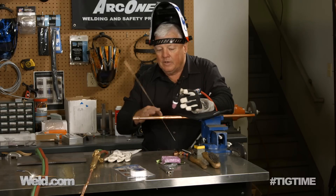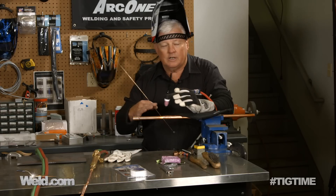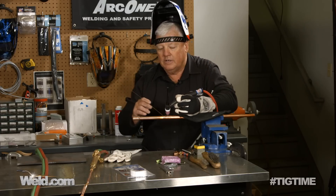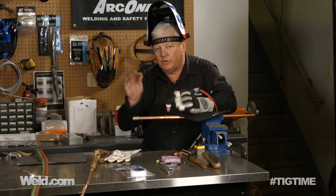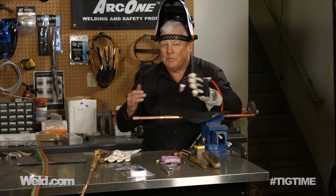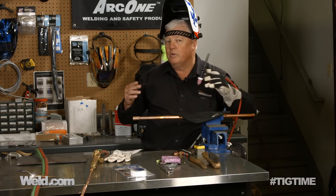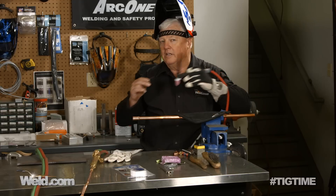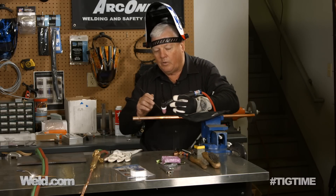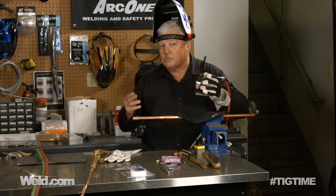In copper, take a look at the copper color now because you're soon going to lose that. It's going to get ugly and it's going to get smutty looking. What I see under the hood is I see this material floating out, wetting out to each side. So just know it's going to get ugly and it'll clean up again later. Don't be surprised — a lot of people don't like doing this because it does look so ugly in the beginning. I'm going to go all the way around, keep rotating it until I do 360, and then I'll wire brush it so you can see it.